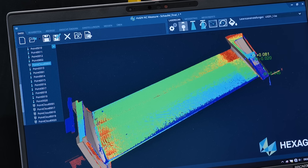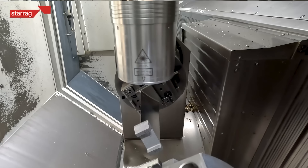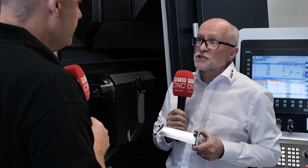You could never do that with a touch probe. So you're scanning the complete blade profile here rather than just touching certain points. What do we want this information for — to remachine or just to clarify that what we're making is perfect? In this case it's to clarify, but we could use the data to then go in and remachine.